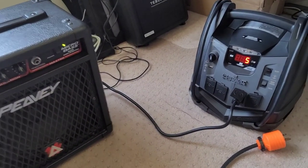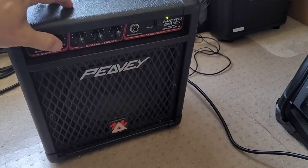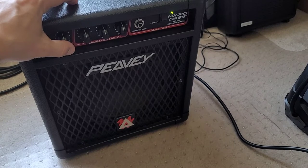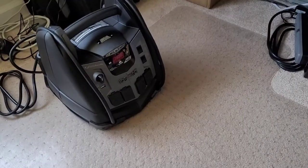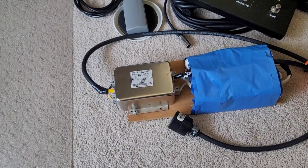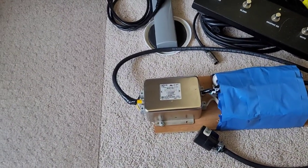For a quick comparison with a modified sine wave, the noise you'd get in an audio application is quite terrible. Unfortunately, a filter like this would not solve the modified sine wave problem—if anything, it could potentially damage the filter or even the inverter.